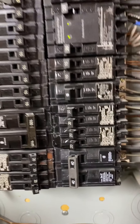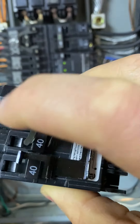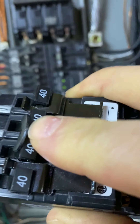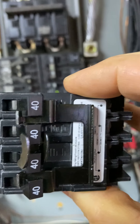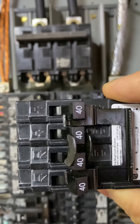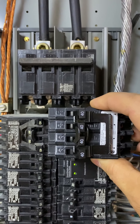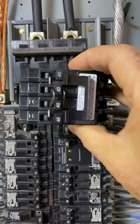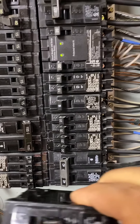What I bought was a dual 40 amp breaker — they tied the two middles together and the two outers together, so you can get two 40s in one package. If I take this one out and put this one in, I can wire both into this one, and that'll free up a slot here. And I have a 50 amp breaker that I bought that I can put down here.